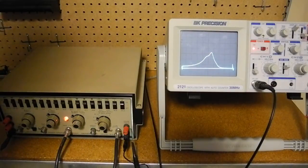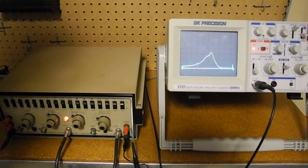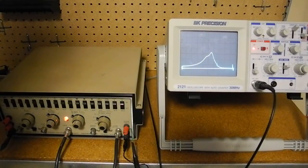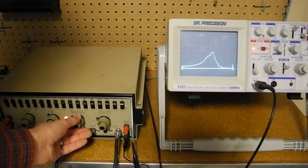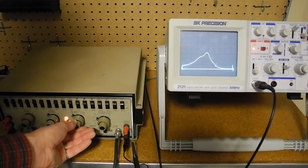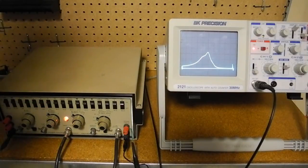We can now also turn on some markers. I'll turn on a 4.5 MHz marker and we're seeing little pips on the display every 4.5 MHz. We could also look at 10.7 MHz, for example. As the sweep moves, the pips will stay at the same frequency. These pips are really useful for aligning particular characteristics of televisions, and the frequencies are selected for commonly used frequencies for television and FM radio alignment.